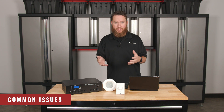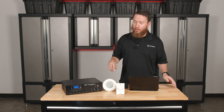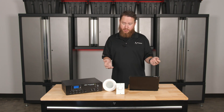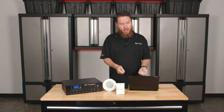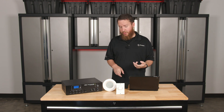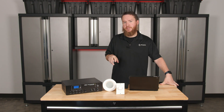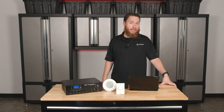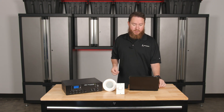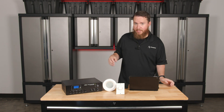Some common issues you may run across include: no sound — do we have power at the amplifier? Do we have good connections? Distorted sound — are all our volumes turned up too high? Are we overdriving the amplifier? Are we seeing clip? Uneven volume is another possible issue — is that because of transformer taps or poor wiring connections? We could also run into a speaker hum or speaker buzz. Are we using the right kind of speaker wire? Are we using side-by-side speaker wire when we need to be using twisted pair? Twisted pair is better for rejecting electromagnetic interference, which is sometimes an issue if you've got fluorescent lights or neon lights in a retail store or hospitality type establishment. That hum can also be isolated to whatever's plugged into some of the inputs, so that's something we need to explore as well.